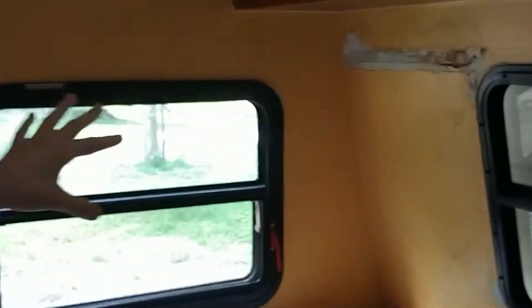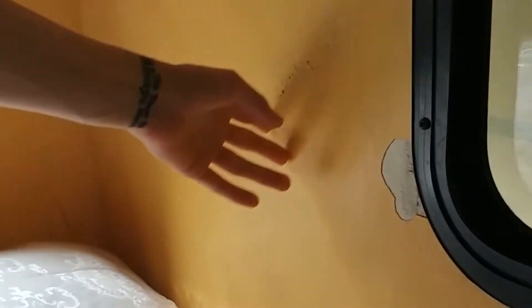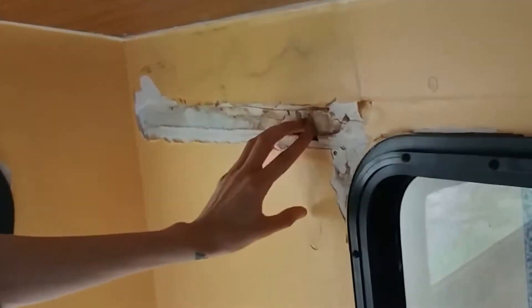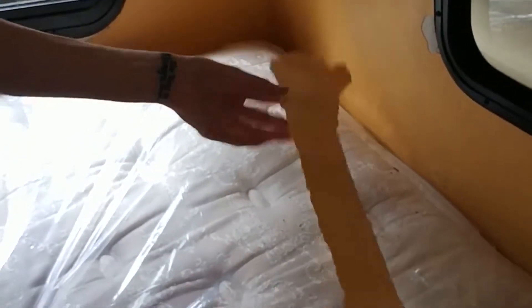So if we go into the bedroom — this is my little bedroom space. As you can see on the wall, there's some pretty significant water damage on this side of things. Alex and I have already taken out both of these windows, completely stripped all the caulking off, and re-caulked the windows and put them back in thinking that would help with the water damage. But it's stormed here a bunch of times since we got here and there are still leaks happening. The paint's peeling over here, there's some discoloration underneath, the wall's chipping off, and there are more discolored patches. The wood in here is all cracking, and when it rains it gets swollen and fills up with water. This piece actually came off the other day — you can see it was drywall taped so the crack wouldn't be so bad, but obviously the water damage is superseding that.